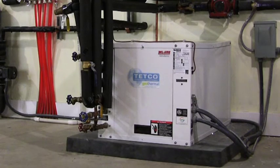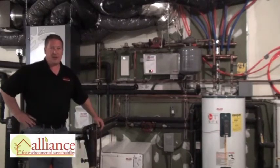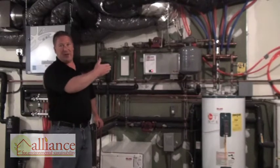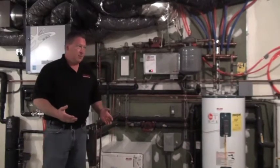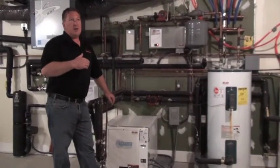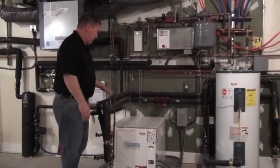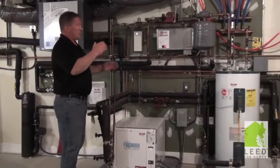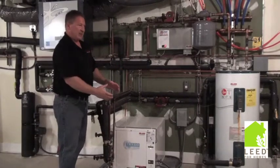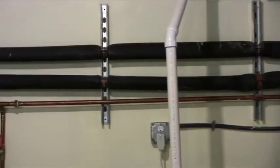This system is somewhat unique — there aren't a lot of them installed, but it does cooling as well. Since it's not a forced air system there's no air movement; it's just circulating water through that big thermal concrete mass which is the house. In cooling season, there's a reversing valve that reverses the direction of refrigerant flow. We take the water coming in from outside, separated by a heat exchanger, circulate water in the floors, remove the heat built up in the floors, and that heat is transferred into the water and piped outside and dumped into the earth.